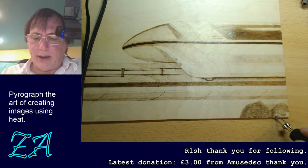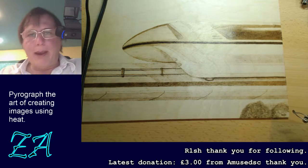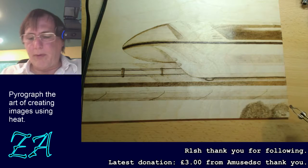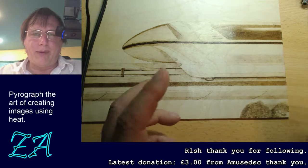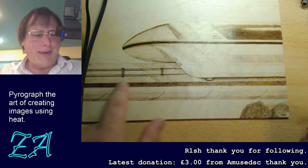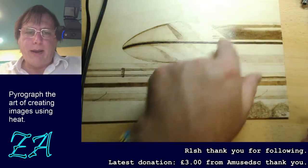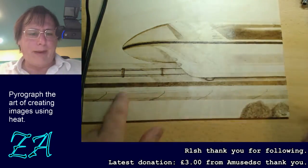It's not getting really dark, and it's taking quite a time for this to happen, and people may get impatient with that. It's not working as fast as they want. So what they'll do is turn the heat up on the tool, or use a hotter tool generally. And wood is a little bit odd. If you were to draw graphs, it takes a while to start to go brown, but then very rapidly goes brown, and quite darkly brown, the longer you hold the heat on. It's that sort of curve.